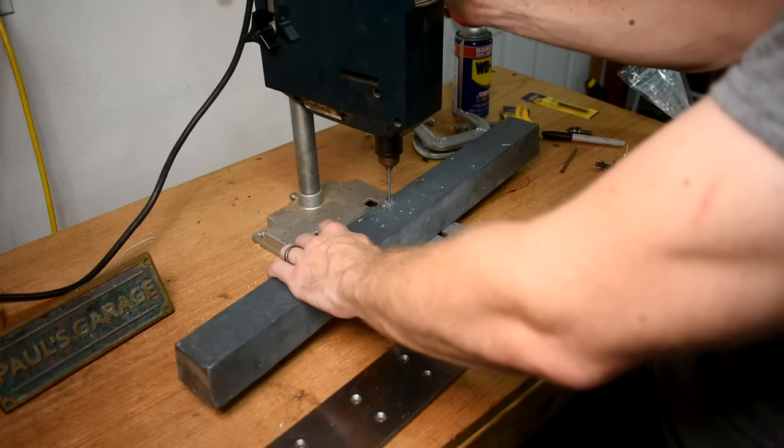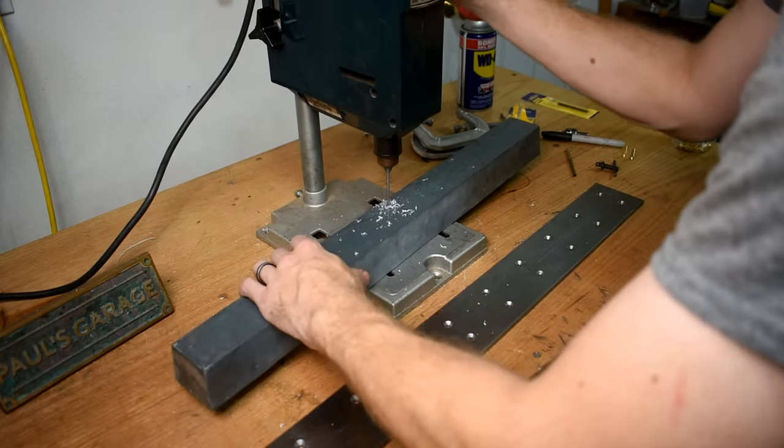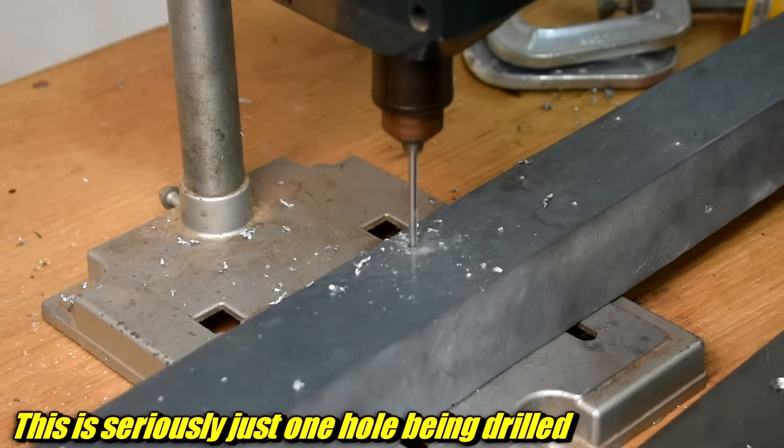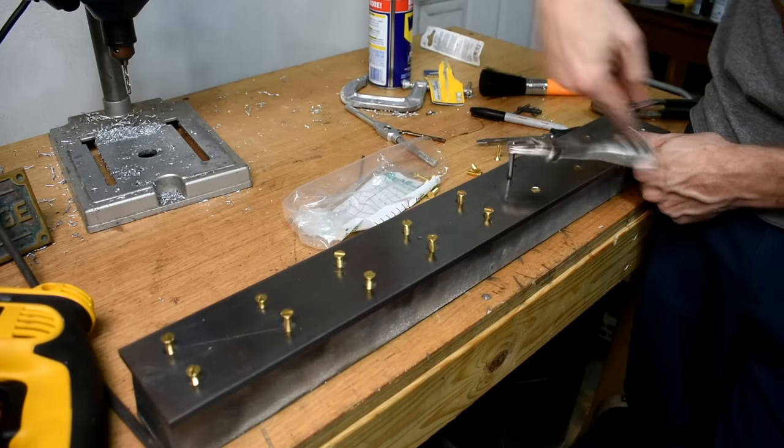It was particularly risky on the center two holes. Old me said he was going to do 16 holes lined up on the spacing underneath those braces. Old me was also an idiot and put two dead center right into the middle brace - that was a particularly difficult one to drill. I basically had to drill up and down, cleaning out the bit several times until it was definitely deep enough. Then four or five times with a tap to make sure it didn't jam up - because if I broke the one and only tap I had in that hole in the middle of the night, I just would have melted the entire thing with a giant torch. Anyway - there's a trick to tapping with this zinc stuff, it's kind of gummy - not as gummy as aluminum, but not as clean as steel. You run the tap in all the way, pull it out, clean it off. I had to run the tap through two or three more times just to get rid of all the gunk in the threads. If you've done it right, when you go to put the ways back on, all the screws will just thread in nice. A few of mine didn't go in all the way - the solution is to just run the tap through again with the ways on. You're not cutting new threads, you're just cleaning up the ones that are there, and then the bolts will go right in.